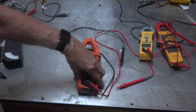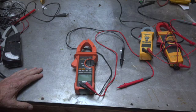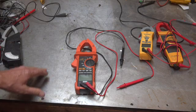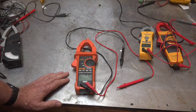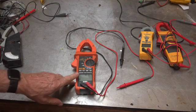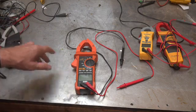The plastic case is not junk — I've had some where the cases would crack, but this one doesn't seem to be that way. I can't find a lot wrong with this meter. The only thing I find wrong is a design function: it defaults to voltage DC, and you have to switch it with the function button. I'm not real thrilled about that because it won't read AC volts when it's in DC mode, obviously. And for the HVAC business, sometimes you want to make quick measurements and you can blow it on this and get yourself in trouble.